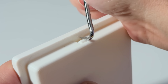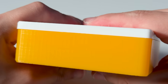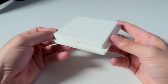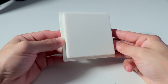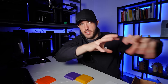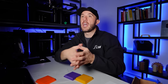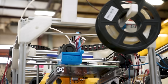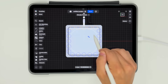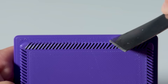These latches have almost 2mm of distance they can travel to create a latch. When tuned in, you can get a really nice fit all the way around. You can also have detents inside the box — actual places for those latches to go — and give them little channels. This is a really good mechanism for making sure the lid fits the bottom box every single time. Many people design parts with just enough clearance and tolerance so they fit, but it breaks so easily when you move from PETG to PLA, white to black, or from one machine to another. It's much better to use all the powers of 3D printing — latches, mechanisms, grip fins — so parts fit together perfectly and always behave exactly as intended, regardless of where or how they're made.